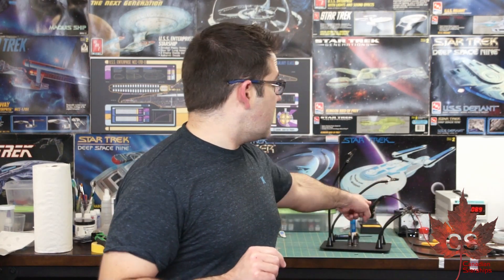I need to get all of that repair work done. I've already cracked open one side and repaired the LED on the Bussard Collector there. Behind me you can see I've got six 0402 white SMDs on their stress test right now. One additional change I'm making since I'm into the warp nacelle is I am putting down blue lighting gels over the white LED strips for the warp nacelles, because then we're also going to go with the frosted chiller grill so that the blue isn't showing until the warp engines are on.